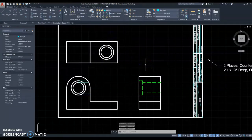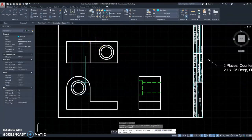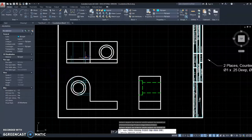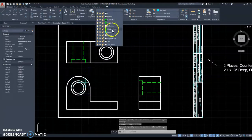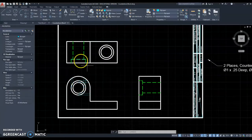I know I'm going pretty quickly here, but you should have a pretty good idea of how to do this drawing. This exact same counterbore has to show up in the top view as well. To do it on the top view, I'm going to take a line and transfer it straight up. I'm not going to go full depth because it only needs to go a quarter inch deep. The middle one does go all the way through. Now I'm going to offset that same quarter of an inch and trim this up. I'm going to select all of those and put them on the hidden layer. That's got those two counterbores taken care of.